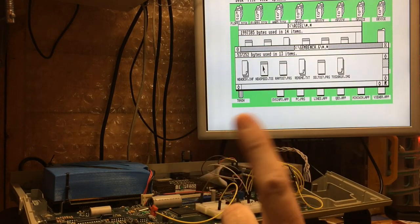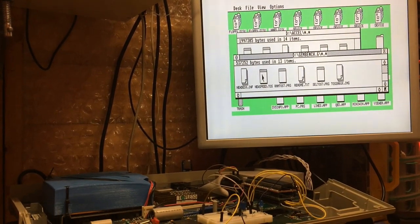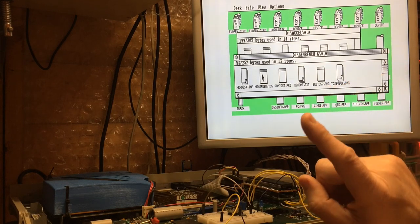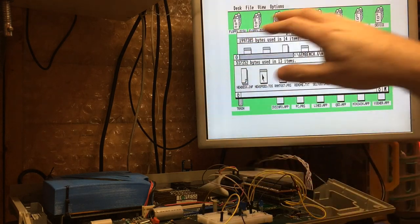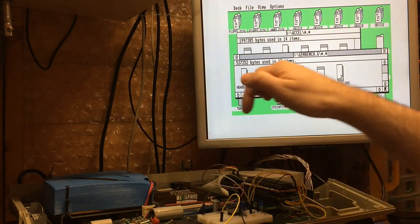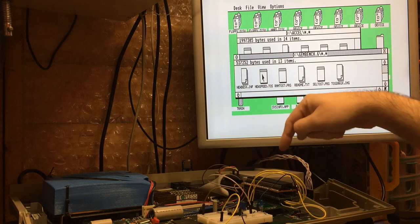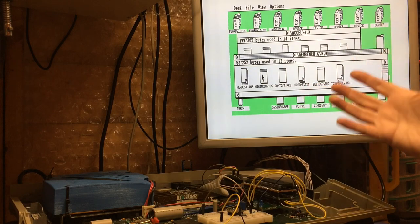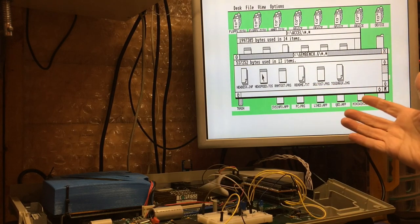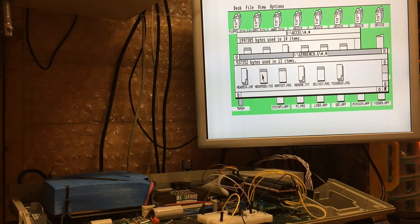Now, unfortunately, there's a catch. And in my case, it is sadly the Blitter. As far as I know, and correct me downstairs if I'm wrong, the Blitter should work with AltRAM. The Blitter sits on this chip down here, outside of the memory management unit, and it can see my memory on here. It asserts bus request, takes bus mastery, and requests on the 23 address lines. It requests the data properly, and my system should be perfectly capable of answering that and servicing it.